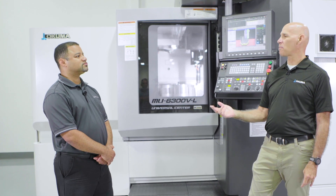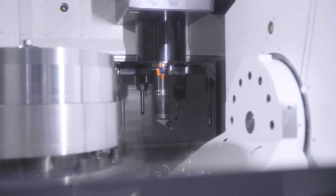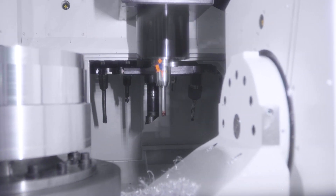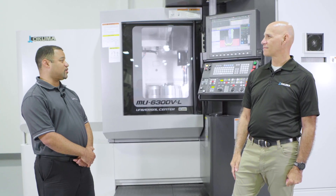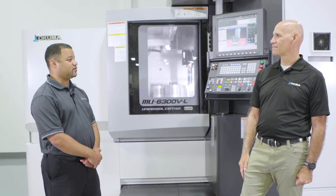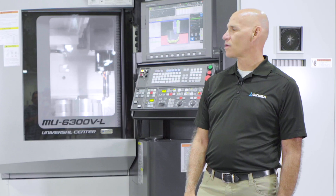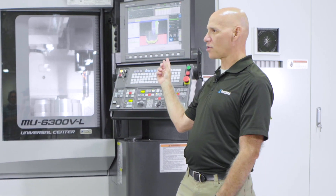So that's going to really help when people are doing setups and changeovers — it's going to protect the machine tool and their investment from a crash. Absolutely. The greatest risk is when you're hand wheeling an indicator over the top of a part and you hit the wrong button, and all of a sudden you lose the indicator. Collision avoidance will stop the machine before it crashes.